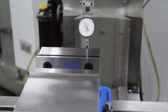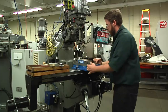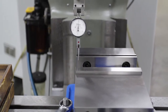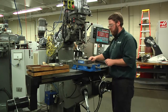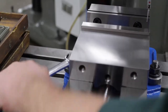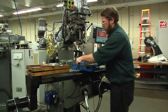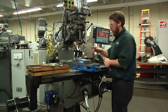Now it says it's within three thousandths, and I still have to go a little further. Before I went a certain amount, it wasn't quite enough because the pivot point is out here. So I'm going to go just a little bit past zero — maybe a half a thousandths. Now we're going to go back to zero and my zero moved about a half a thousandths as well, so I'm going to re-zero that. I'm looking for zero, zero all the way across. It's within probably 0.0001 — probably within one ten-thousandth of an inch right now. So now I'm going to snug up this side equal to this side, go back and snug the other one further, then finish tightening. Whenever you tighten down bolts on a table, you want to work them evenly to keep the vise square and uniform.